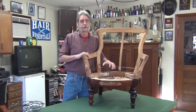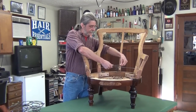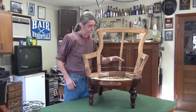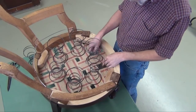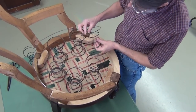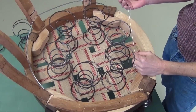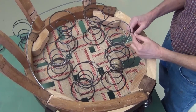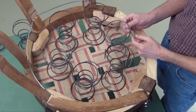Using a proper spring height can sometimes be pretty challenging. In this case, I need to make about a four inch crown on the seat, and I want these springs to pull down just below the edge wire. I'll start the springing by placing them around the perimeters on all of my designated marks. There's a little bend in the spring coil — this is the top, and it's going to get pinched together as we tie it. I've got about a four yard piece of nylon button cord pulled through a beeswax ball. The beeswax helps eliminate snarling and secures much better. I'll do the stitching with a three inch bayonet point needle.